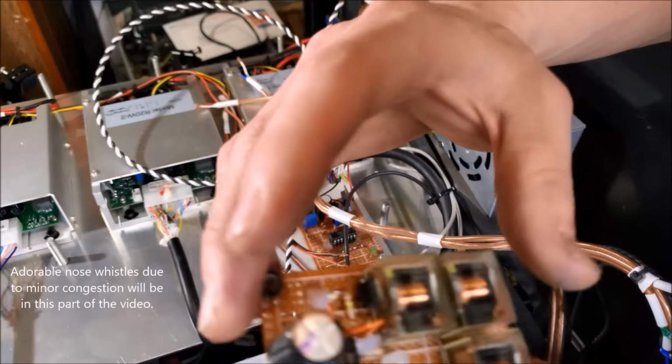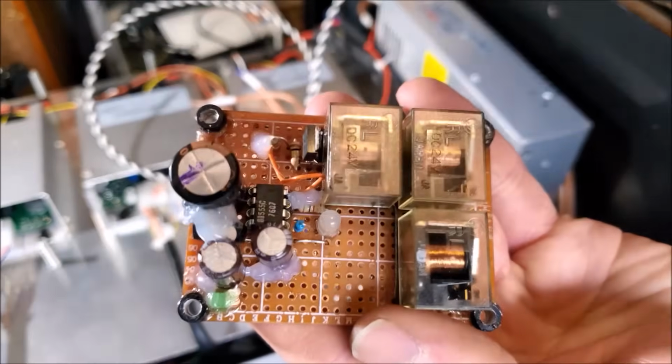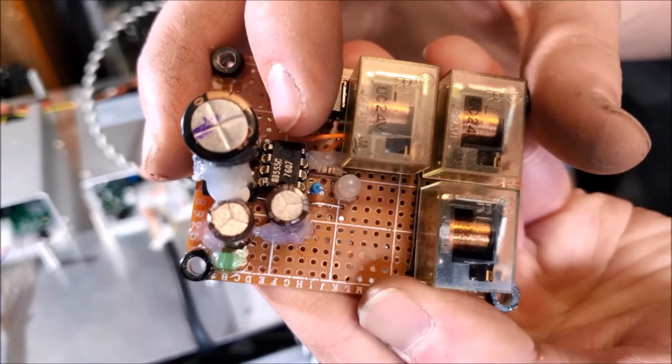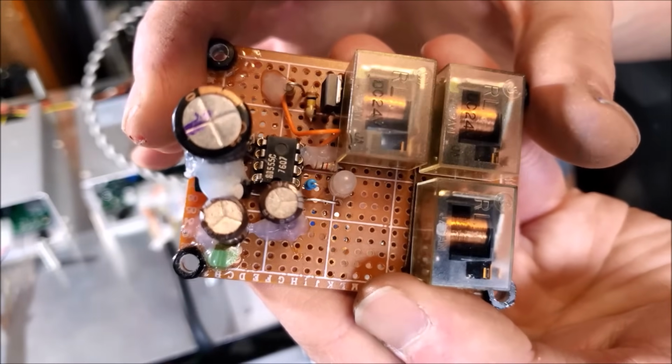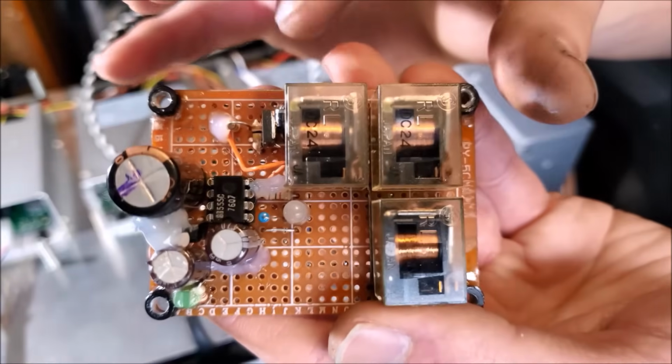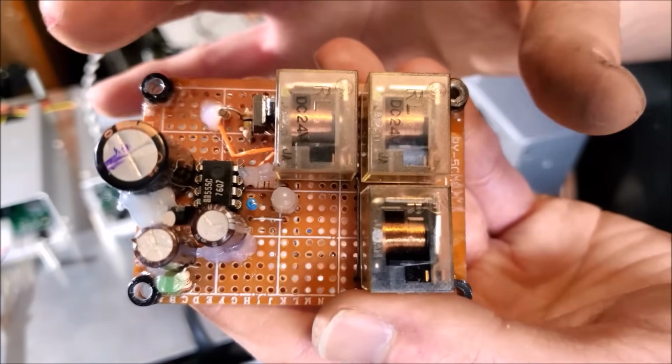To do this, I have made myself a little startup delay board. It's a very simple delay circuit, just uses a 555 timer. And I can also put information about that as well in the description below. And then I have 3 relays here, one for each color.